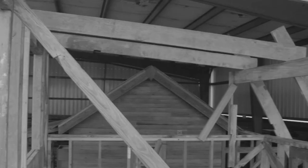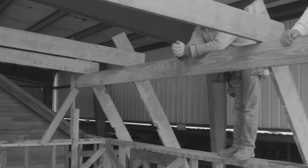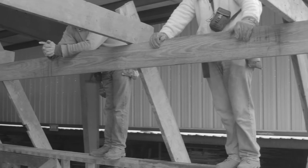In a conventional gabled roof, the first step is running your ridge beam — you put up a temporary support that's going to be offset so that you can attach a ridge beam to the side of it. You set your height to get the final height of your house, or close to it, since you'll still have a little roofing material on top, and then you run the ridge beam down it.